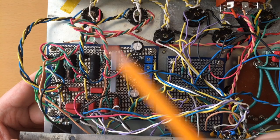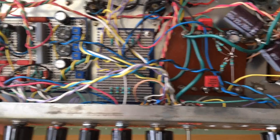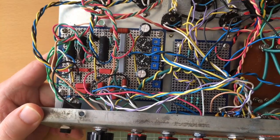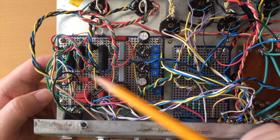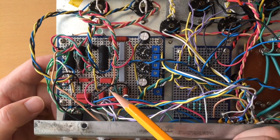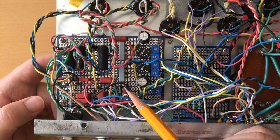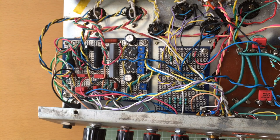If I try to lay out all this circuit using turret or some other kind of technique, I will never be able to fit all the components. But let's now talk a bit about the preamp stages. I have 3 preamp stages. I have an inverter, which is a concertina style or cathodyne phase inverter.